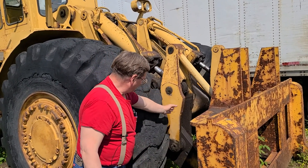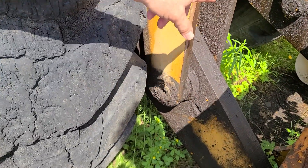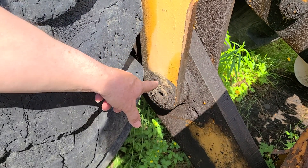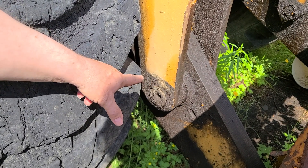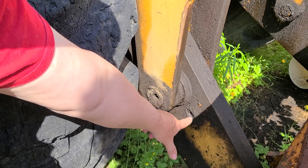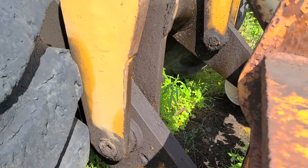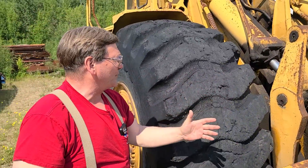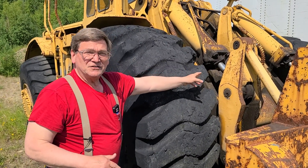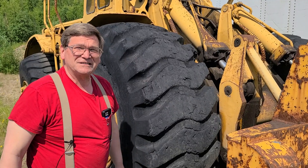What I wanted to talk about here on line boring is you've got a bunch of pinholes. Now we could line up on this hole with whatever the hole is, but this hole may not be in the right position right now. If this hole is a little bit forward and doesn't match with the other one over there, then as these parts move back and forth, they're going to put a little bit of a sideways force on the rods.